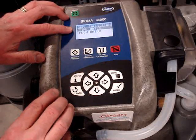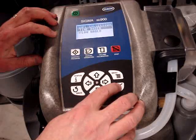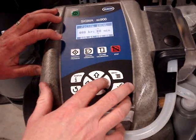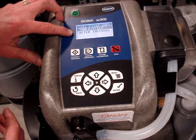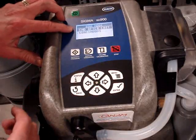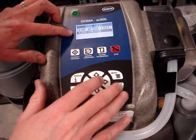We can take samples based on time — say every 30 minutes or every 60 minutes — or based on flow if we have it hooked up to a flow meter. So taking a sample every 30 minutes, I could change that using the arrows. I could take the first sample immediately or after the first interval. I can take a certain number of samples and end after the last, or run continuously every 30 minutes until either the bottle fills up or the sampler is shut down.